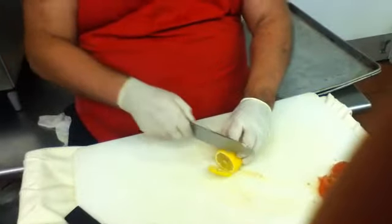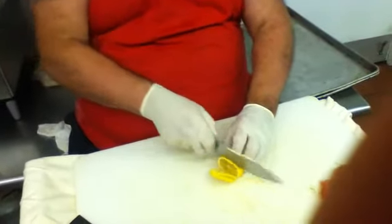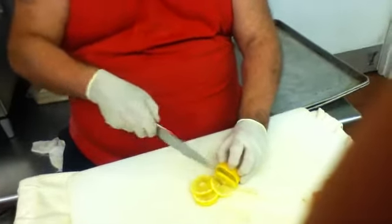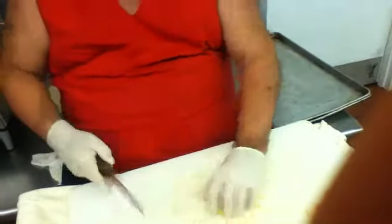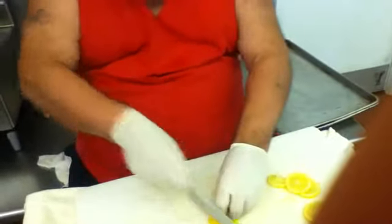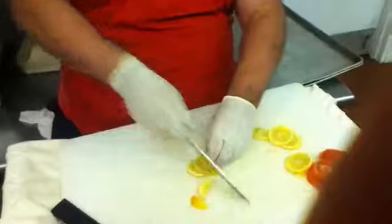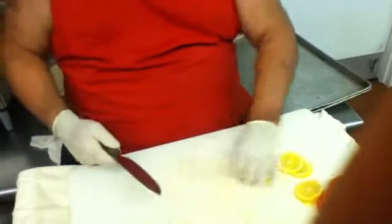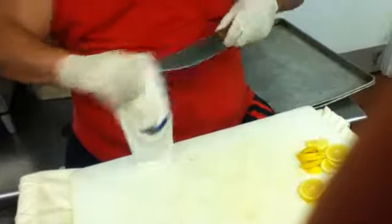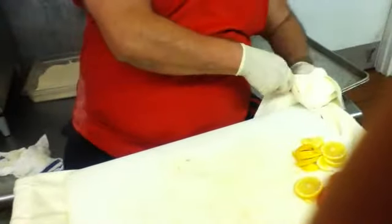And as I'm making knives, I'm making one for me. It's going to have a lot thinner edge in it. This one's about 0.03 behind the edge, so it's a little thick. The next knife I'm doing is going to be 0.01 behind the edge or thinner, and you're going to be able to do a lot more fine work with that. This is more of a cleaverish style. Wipe it and dry it every time. Chef knife. That's if you want the carbon steel.